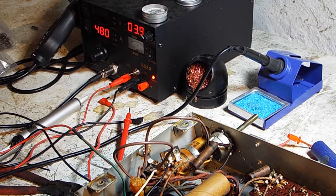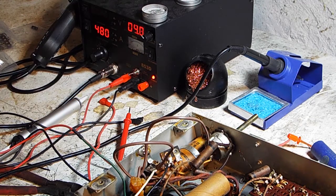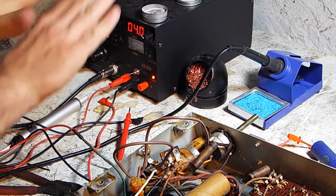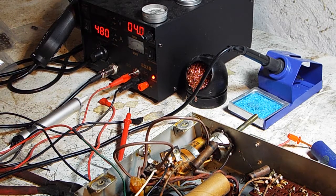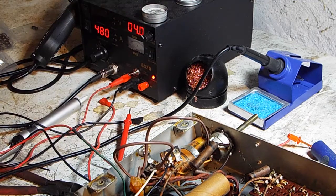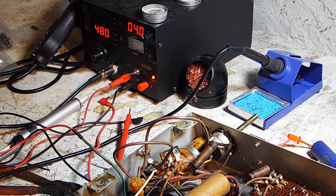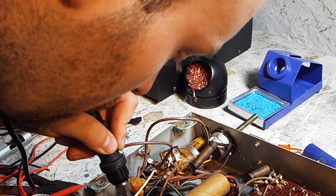Our amp meter is actually barely moving, and of course it's not going to move, because we have two plates separated by a dielectric, so technically you're not going to get any current flow through this. This is basically like an open circuit, but what's happening is you're charging one plate negative and the other plate positive, and that's how a capacitor works, and that's why in DC voltage, that's essentially an open circuit.